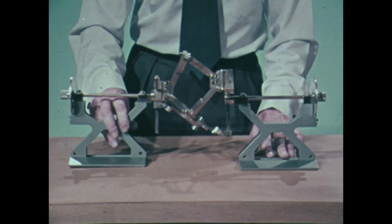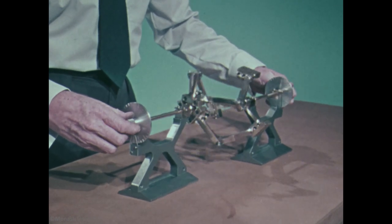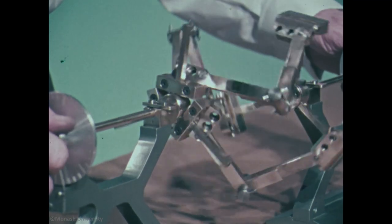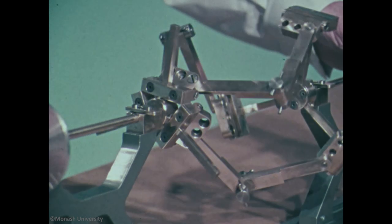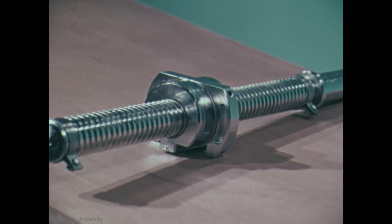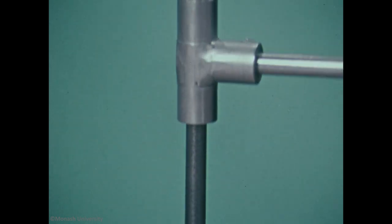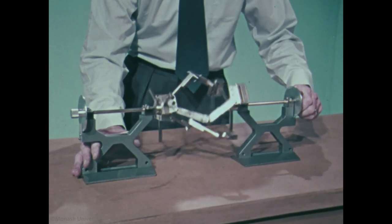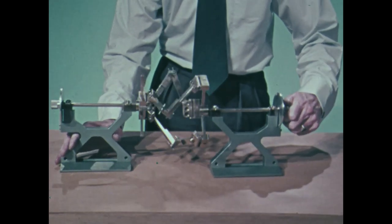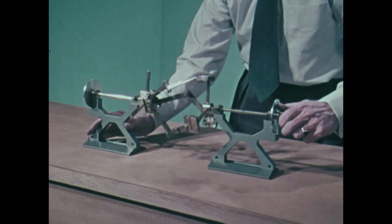They're still plunging. This demonstration model is primitive — it shows up the geometrical principles, but it's not a real engineering design. In parallel shaft couplings, just as for the others, there's a wide range of possible joint replacements, again consistent with the general theory. We can replace hinges with screw-nut joints, or even with cylindrical joints that permit sliding and turning, so long as the required parallelisms remain and so long as there are five degrees of freedom in each connecting chain. The theory of screw systems reveals many variations and identifies situations that must be avoided to ensure proper functioning.